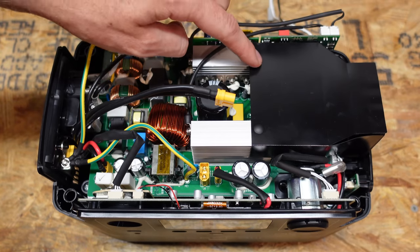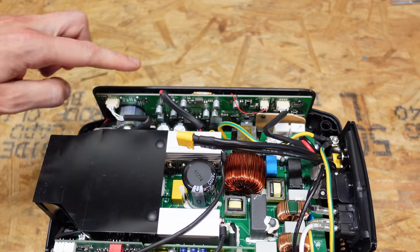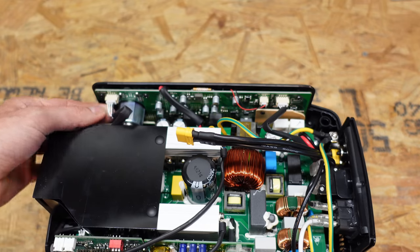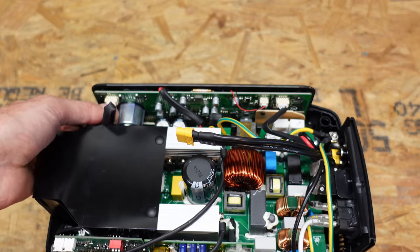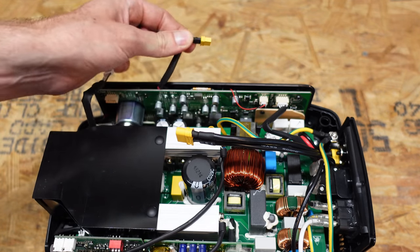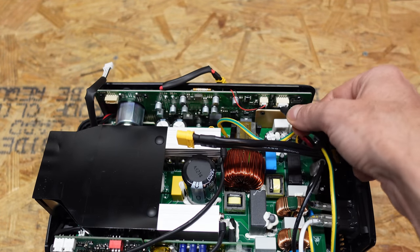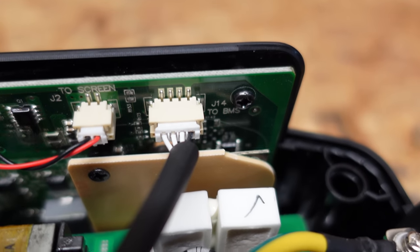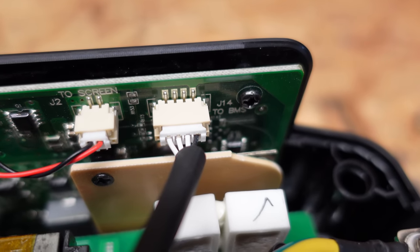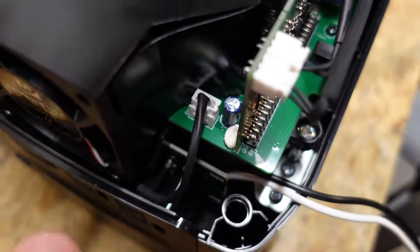What I really want to do is see if I can get this inverter board off and take a look at the battery inside. So I'm going to disconnect as many of these things as I can. The front display board has a number of connectors. The first one on the left says 2PSDR, and that is going down to the inverter board. The black one says J3 — it looks like that is providing DC power to the front, probably for the USB ports and power delivery ports. The rightmost connector says 2BMS, so I imagine this is going down to the battery, but there are only four pins there so perhaps that's a communications port and not a direct BMS connection to the series pair cells.